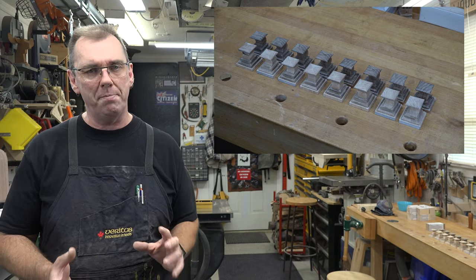If you want a sharper corner up top, I might even suggest placing a blade entry hole right up here. And it's more of an exit hole so that you can bring this around into the waist area. After you pass this point, waist area, turn your blank around and come down this way. You'll leave your blank intact and only lose a little circle up here. So I'm going to cut these blade entry holes and I'm going to cut a bishop and I'm going to come back and show you what we end up with for this piece.